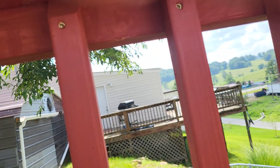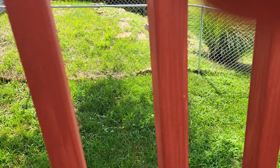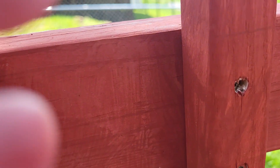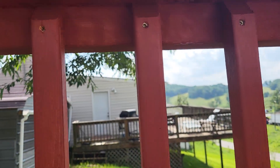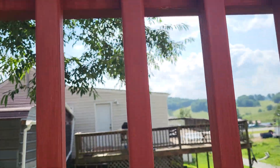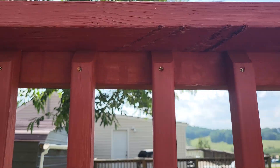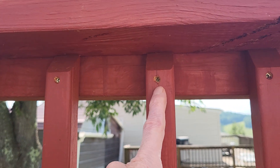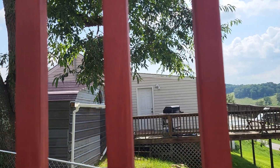I put them on the inside of the deck so you can't kick them loose. I also used screws to hold these in — two screws at the bottom, which you can see there, and one screw at the top. I pre-drilled the holes. A lot of people just use decking nails, but it turns out a lot better and you don't split your pickets. With a decking nail, a lot of times your pickets will split right where you put the nail in.